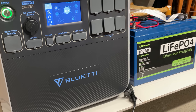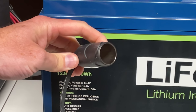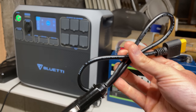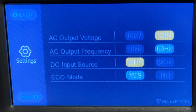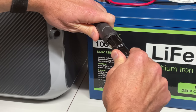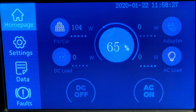For the final test, car charging. Rather than drag this to my car, I'm using an external LFP battery with a female cigarette adapter, plugging in the included male cigarette lighter adapter and into the XT90. You have to make sure you change your input source from PV to car or this will not work — trust me, I've learned the hard way. Once hooked up, I got a very solid 100 watts or even a little bit more, which I think is the perfect charging speed. If you pull too much power from your car, it's going to be very unhappy.